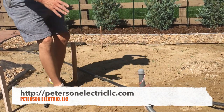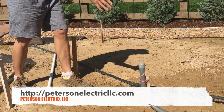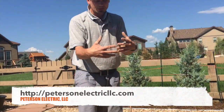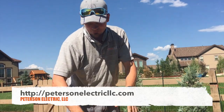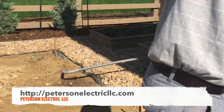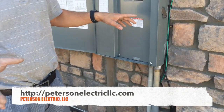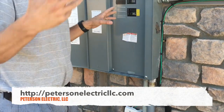We don't want to drill the fiberglass or plastic bigger than we have to. This approach also allows us to move the tub later — the hot tub guys drop it, fill it, I come back later and don't have to worry about scheduling with the customer. I just pull the wire, fill it up, fire it up, and we're good. Also, a lot of people ask where's my disconnect — this panel is within 50 feet, which addresses that.